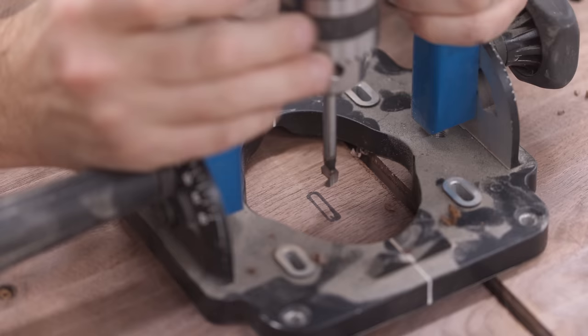I'm trying something a little different for that edge profile. Normally I like a big round over on the bottom, but on this piece I thought a sharp chamfer would look really nice. I went out and picked up this 60-degree chamfer bit online — this thing set me back $120. I'm really happy with how that steep chamfer looks combined with a slight round over on the top; it definitely gives it more of a mid-century vibe.